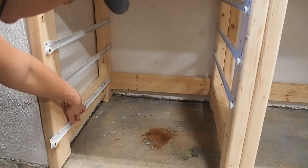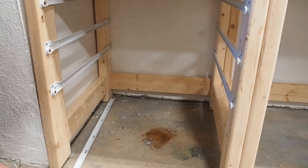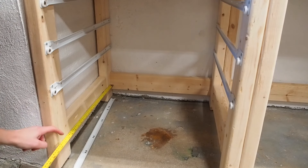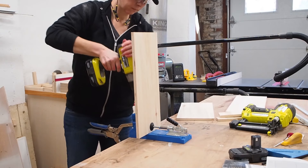When I reached the bottom drawer, I noticed I would have an issue with the rear 2x4 cross support being in the way. It won't be a problem for the slide itself since I can install it just below the 2x4, but I'll need to make the drawer box itself shallower. After a quick measure, I trimmed down the side pieces I had previously cut, and assembled the box just as before.